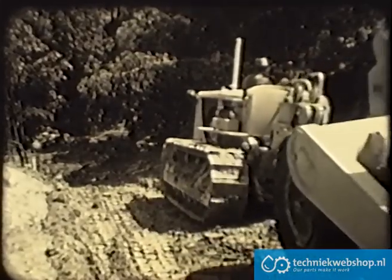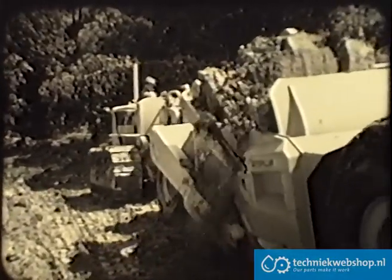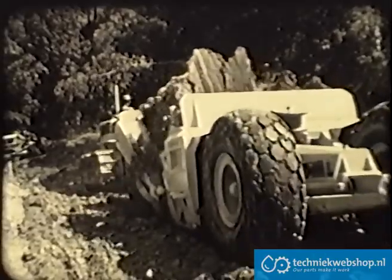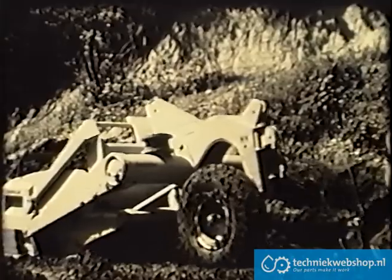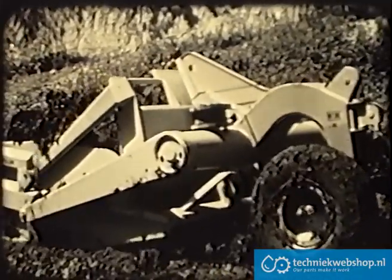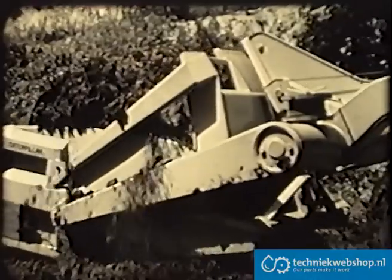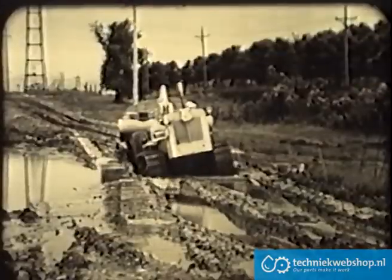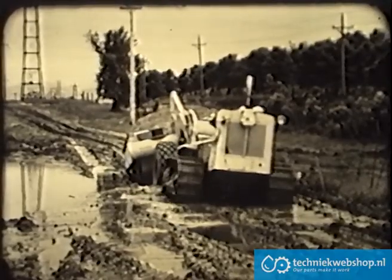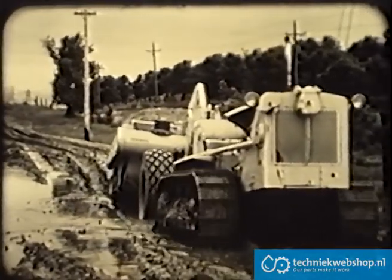On most work, shovel loading is unnecessary. With the load building up to a one-to-one slope, the Number 80 carries as much as 18 cubic yards, the Number 70 a full 11 cubic yards, while the Number 60 handles 8 cubic yards. A wide range of materials and conditions is handled with these modern earthmovers. At one extreme is mud that oozes around tracks and tires, yet the large supporting area of each gives both tractor and scraper all the flotation necessary. Even muddy streams fail to slow down these earthmoving giants. The weight of the loaded scraper is unevenly divided to lessen the weight on the front wheels, so even under extremely muddy conditions, the front wheels ride high and the large low-pressure tires carry the unit over the muddy bottom.